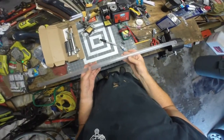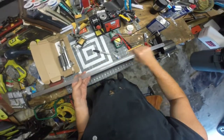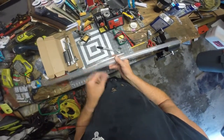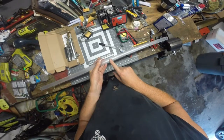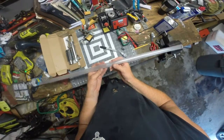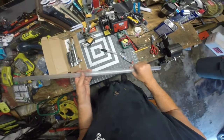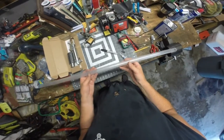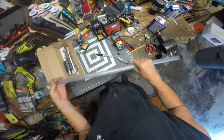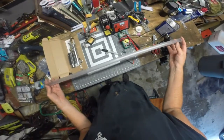Alright, so unfortunately I think I had the camera microphone off, but I have taken sandpaper, first 100 grit and then 1000 grit, to turn this Custom Saber Shop blank that used to look like this into this. So now we've got it cut to length, and I've sanded the outside. The reason we sand the outside is that the people doing saber combat were finding that the more their blades got scratched up from combat, the more even the light distribution was on the blades. So then everybody started sanding their blades, and it was kind of an accidental discovery.